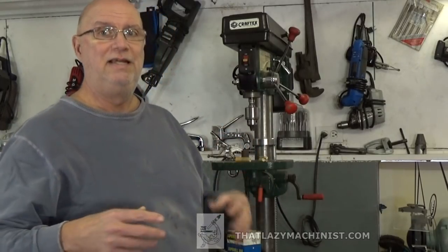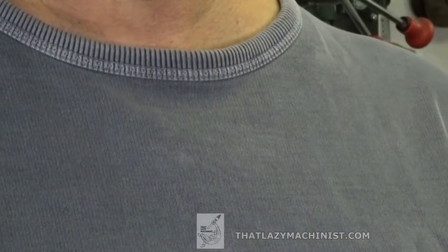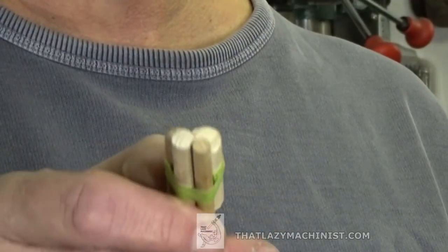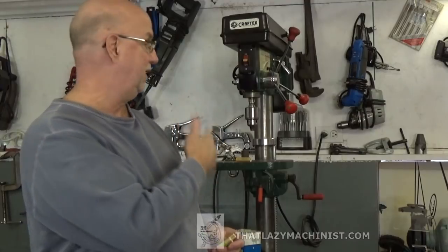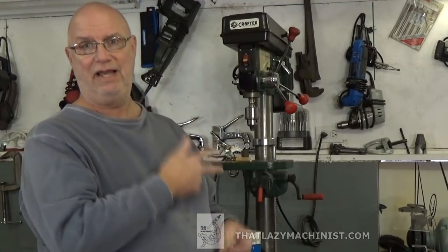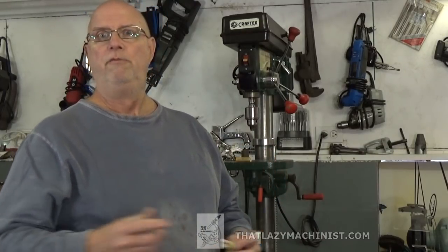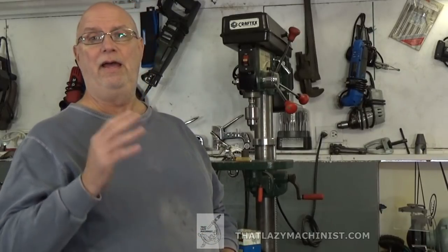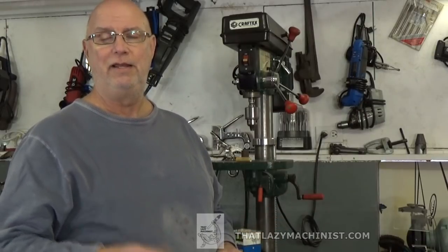The problem now is he needs more, because he's using different size dowels now. And here are the 4 sizes that he's going to need to drill holes into. And well, I'm going to be making the same type of jig, but I'm going to make him 4 of them. And instead of using hex stock, well, I'll be using square stock. So, first things first, let's move over to the cutoff bandsaw and cut our blank pieces or parts to length.